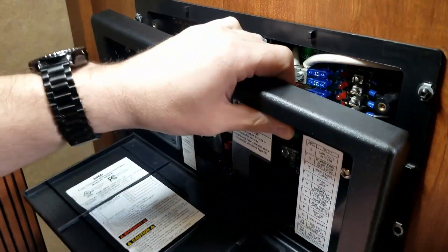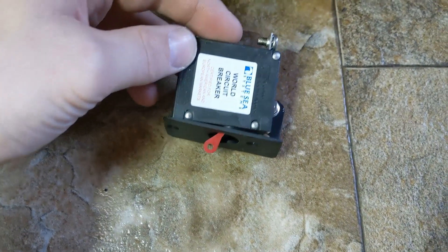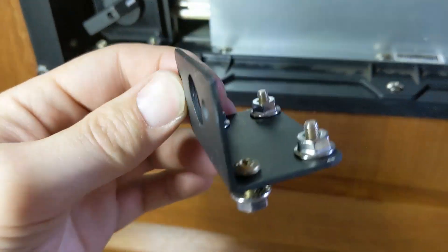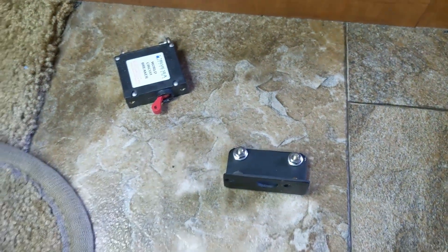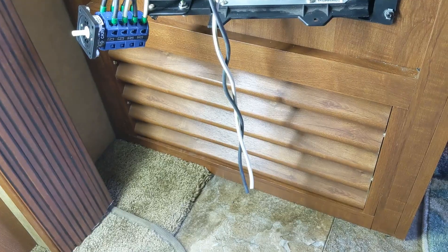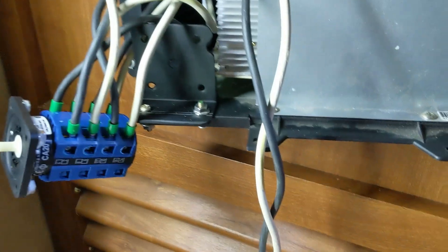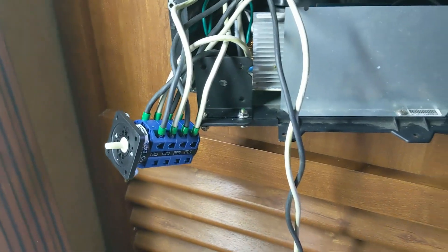It's already pre-made to cut out. I've prepared some holes up here so I can mount this bracket for the solar panel circuit breaker — it goes right in here. The problem I have is these nuts are going to be hard to hold tight in here, so I'm going to put a little dab of epoxy on them so that all I have to do is put the screw up from right here. That will make it so much easier when I go to install it. Then you can route the wires to that so we can disconnect the circuit breakers or disconnect the solar panels. I'm installing a bypass switch for the inverter — just in case something happens with the inverter — so I can flip the switch and everything goes back to normal, back to the way it was before we had the inverter.